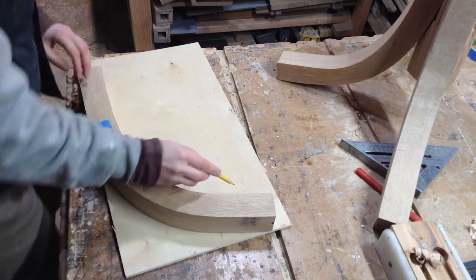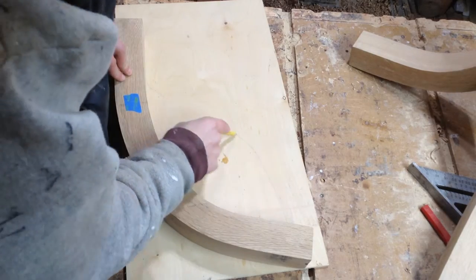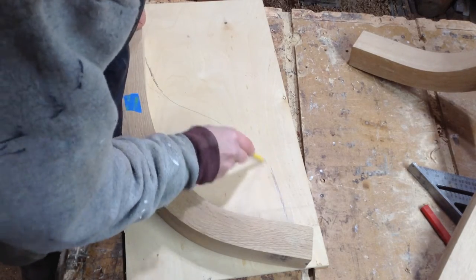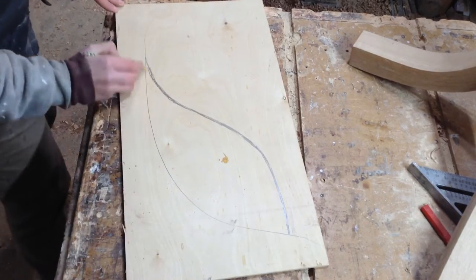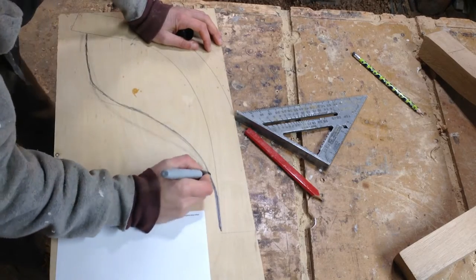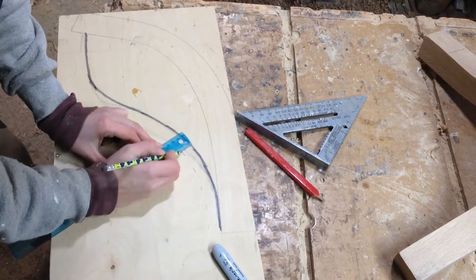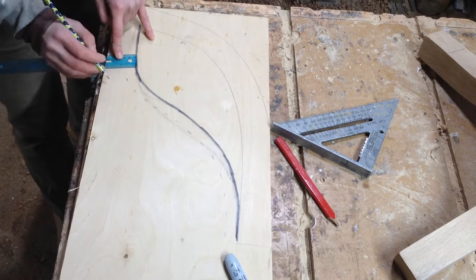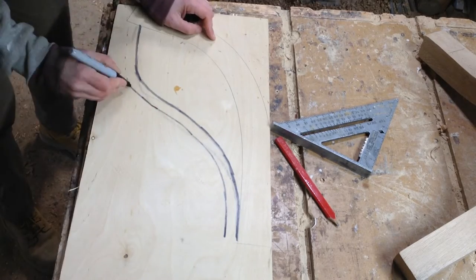In the original drawing it's almost like an S-curve - it kind of comes up, curves a little bit, then flattens out and is flattened and screwed into the top, whereas on the bottom it'll actually be mortised in place. I made a rough curve that matched the drawing - it didn't have to be exact. I put some Sharpie on it so everything was easier to see, thickened that original mark to three-quarters of an inch because this material going in the legs is going to be about three-quarters square. I drew another line and then cut this shape out.